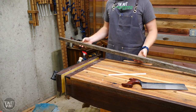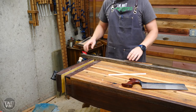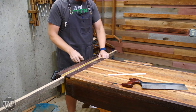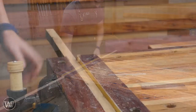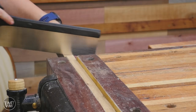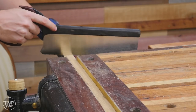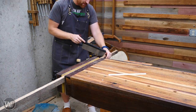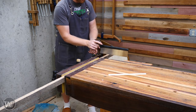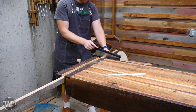I could make one five and a half feet long, but I really don't need that — I only want about four and a half feet, so I'm going to cut a foot off. I'll put it on here with about 14 inches or so hanging out, grab the saw and cut it down. I like to start on the push stroke. Once you learn to hold the weight with the bottom horn and lift up on the saw, you can put a very light touch on that first pass and you've already made a cut.